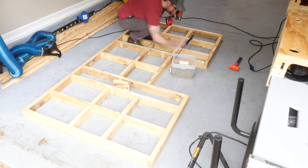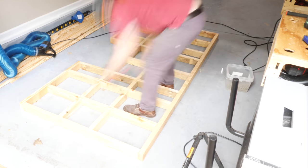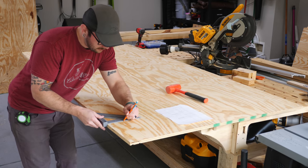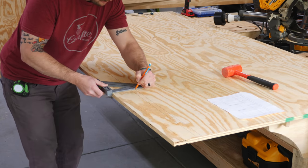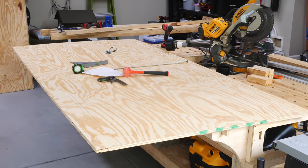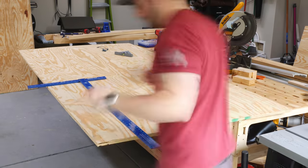With the blocking installed, the framing for the top was assembled, and next I needed to get the three-quarter inch plywood top attached. Before doing that, I went ahead and laid out the locations of my T-track on the top, and having these locations marked out showed me where I could add nails or screws while attaching the plywood top to the framing, as I definitely didn't want to run through any nails while routing the grooves for the T-track later.